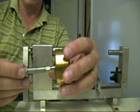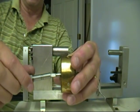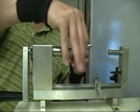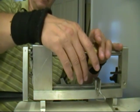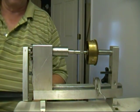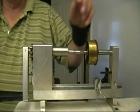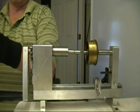What you do is take your barrel and find a winding adapter that fits it properly. Put it inside there, then put the barrel in. Move the tail stock up, which locks the unit in there so it's not going to jump out at you. And you look at the way the spring winds. Make sure you wear gloves and eye protection.